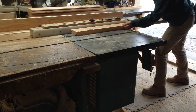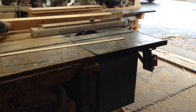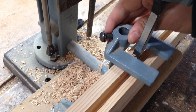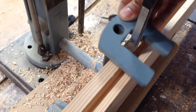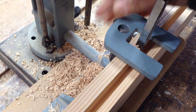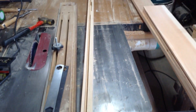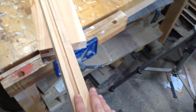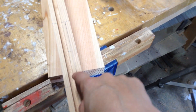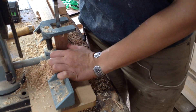You can see I'm cutting those grooves — it's about an inch groove so I did it in two passes. The middle rail is the only one getting cut on both sides so that the panel can meet in the middle. Then I cut the stiles down to size, remembering that the mortising machine needs pieces to be about four and three-eighths. I'm utilizing the dado groove in order to cut the haunch. I'm doing a double tenon on these, so there will be a gap in the middle with haunches on either end.